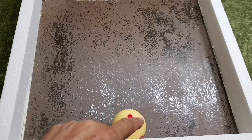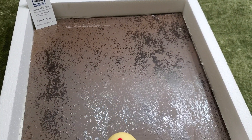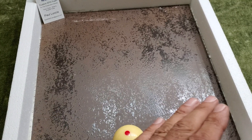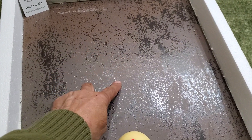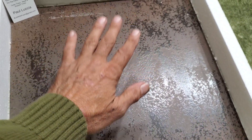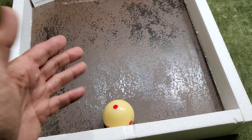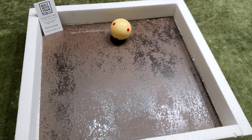We can locate this drain anywhere inside this perimeter and always have perfect slope. We sell you the foam undermount sink plus the piece of foam that gets cut away so that you will have the assembly you need to hold this piece of tile down. Some thinset or adhesive, the tile, the curved piece of foam which matches the curve underneath, a piece of plywood, clamp it together, and that's how you get this perfect shape every time.